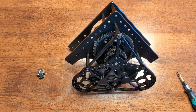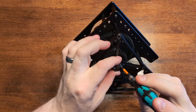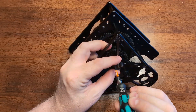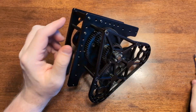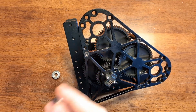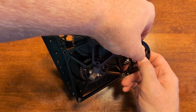Now is also a great time to install your absolute magnetic encoder. We're showing the Thrifty Bot absolute magnetic encoder here, which is included with the kit, but you can use other absolute encoders in FRC. There are threaded holes that match up with the CTRE mount pattern, and there are also some number 10 holes there as well. We've also included two 8mm flange bearings that press into the top plate to help support the shafts on your motors.